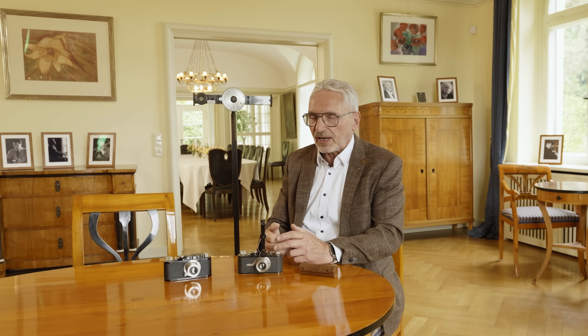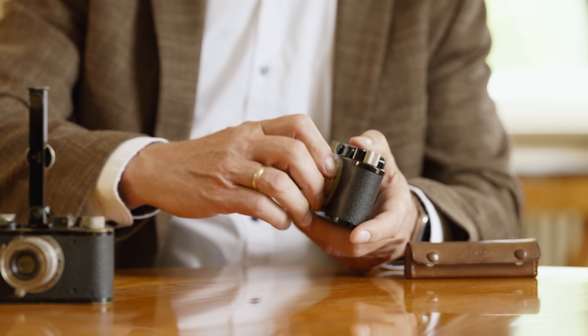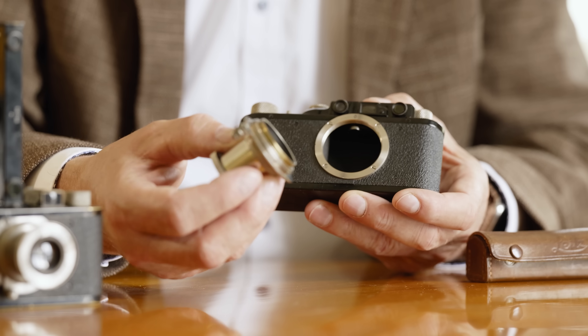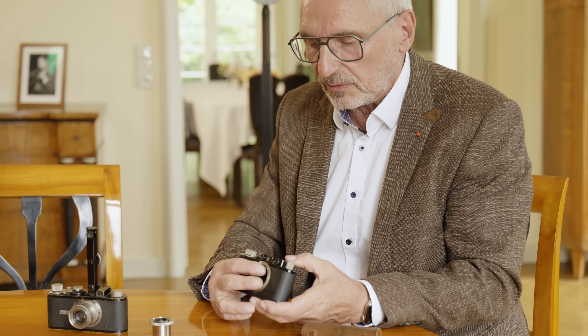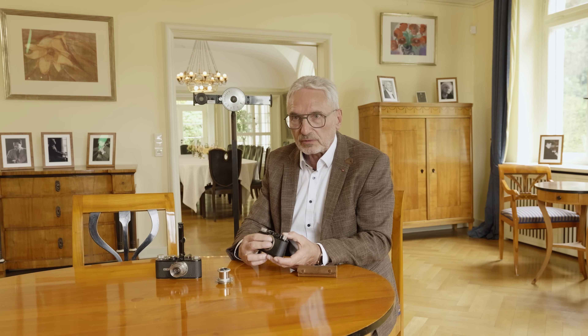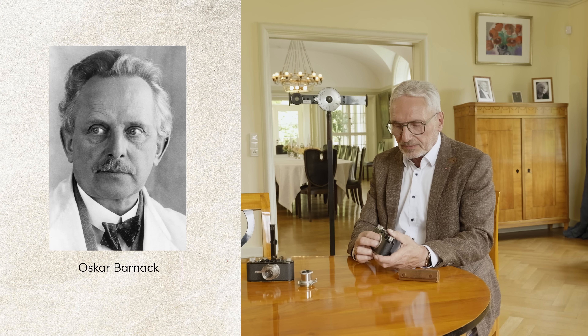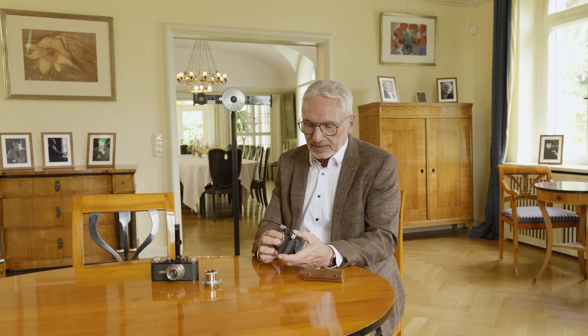It made it faster to use, and the Momentaufnahme was much easier to realize. When you disassemble the lens, you can see a lever which is moved by the lens itself during focusing. The position of this lever gives the information to the rangefinder about the distance the lens is focused at. This functionality is still in the M-camera today — so we can say the soul of Oskar Barnack is still buried in the M-camera, nearly 100 years later.